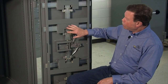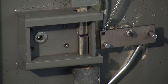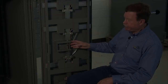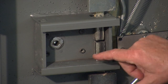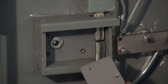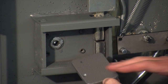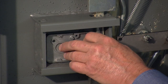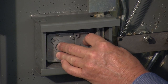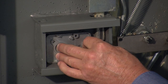We've removed the entire door panel so that we can see the whole mechanism and get a better view during the installation process. Normally you'd simply be working through a much smaller area. This lock mounting box uses raised studs, and this is where we'll attach the mounting screws for the lock body. We can use this flat cover from a discarded mechanical lock to check if it rocks excessively against the studs, which would indicate uneven studs requiring shimming.